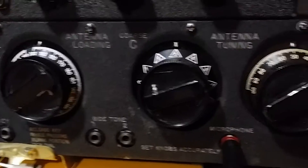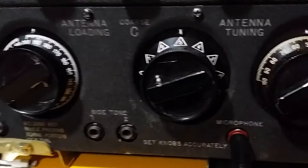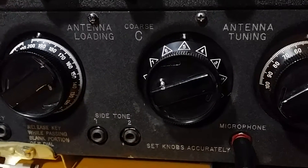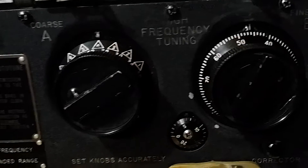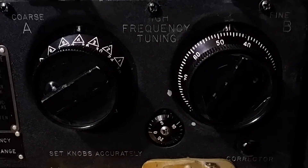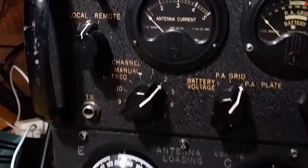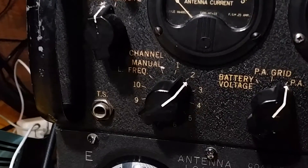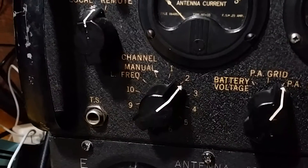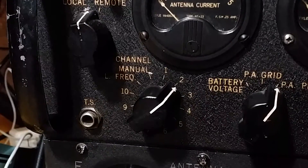These three mechanisms are your Auto-Tune for the RF stage. These two over here are for your frequency — basically a VFO. You set your channel up top here. Right now it's set at channel 2, which I think is 3885, and channel 3 is 3880.